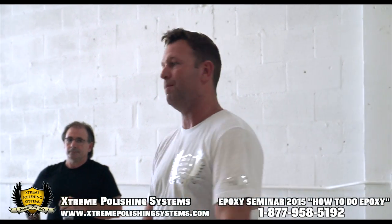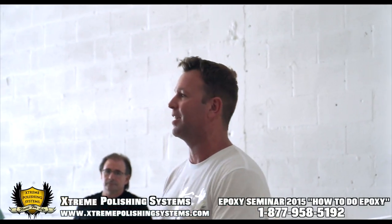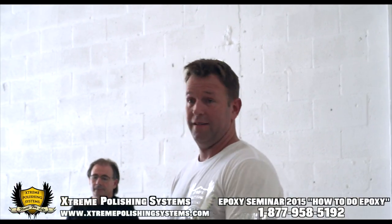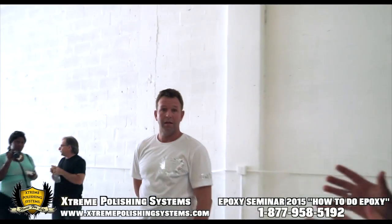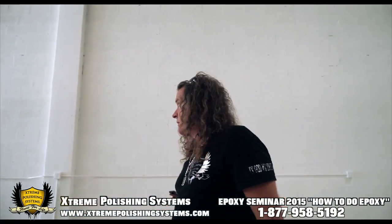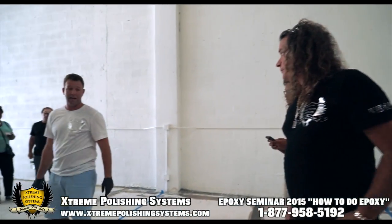You're gonna have to scrape. You're gonna have to puddle it up. You're gonna have to get it xylene. It's a chemical nightmare. So mixing is pretty much 100%. It's the key to this job. Always use the same container for your resin, and always use the same container for hardener. I'm gonna mix it all together because we're just demonstrating.